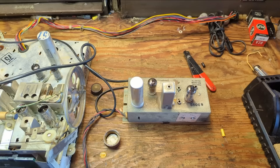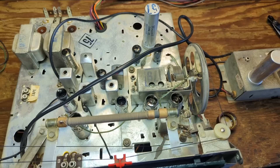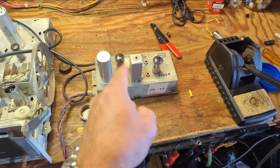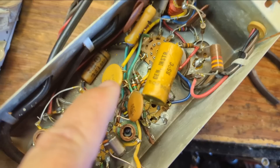I've been talking to a few people online about this brand and there's mixed feelings — some people say it's really cheap. I don't deny some cheapness, but it's not the worst I've ever seen. The fact that they're using Mallory capacitors — that's good quality. I've seen cheap manufacturers that used crappier electrolytics, but Mallory's here is probably why it still worked. Let's peel the bottom off and see what's going on — there's a little more going on than I thought. We have two paper caps plus the electrolytic.